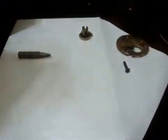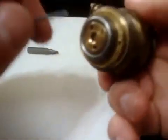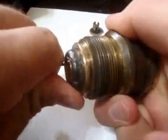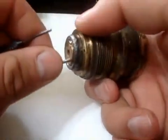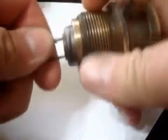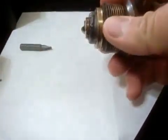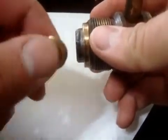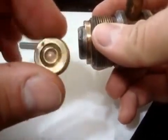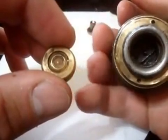So next I'll take off this, which is for holding the primer here. It comes off pretty simple normally. I'll grab two. They're pinned in place, which means it took a lot of force to take it off the first time, but after that it's fine. You see, the primer's in the middle there, and it hasn't been struck. Inside there you see the firing pin.